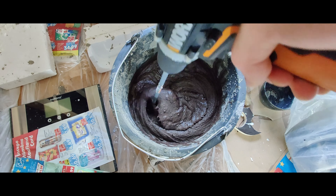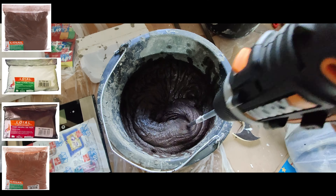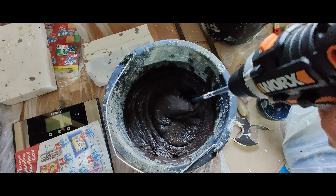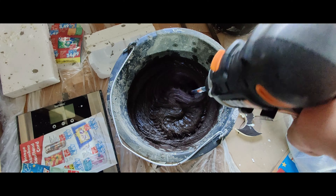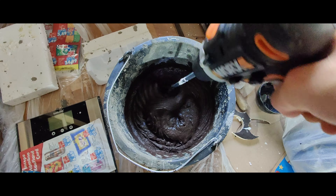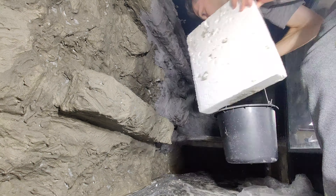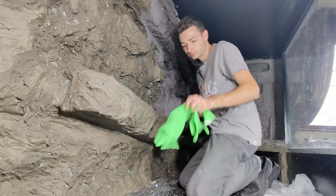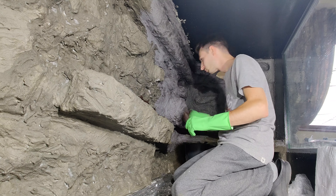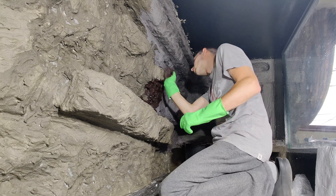This is the look of the CM17 tile adhesive after adding cement pigments — they are very cheap and come in various colors. There's really no precise recipe to obtaining a color; I got a different tone every time and ended up using mostly brown, black, red and white. As I found out in a rather painful way, when the CM17 tile adhesive dries, it leaves very sharp protuberations that can cut through your skin, so the solution is to use cleaning gloves.